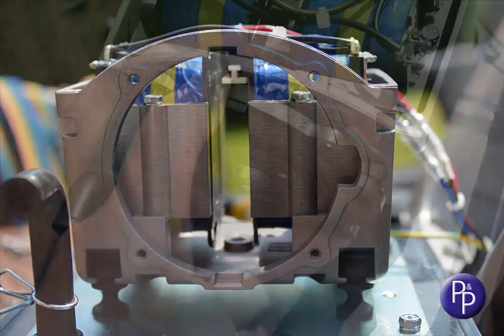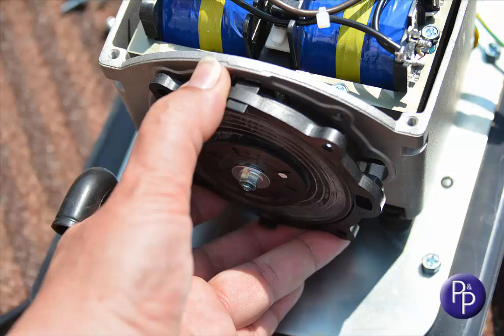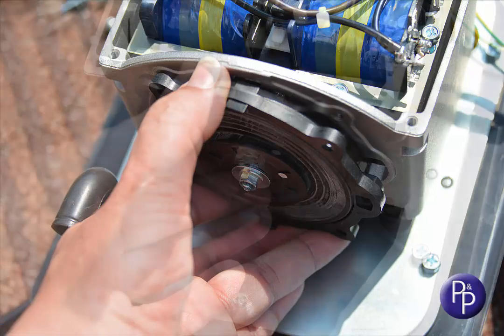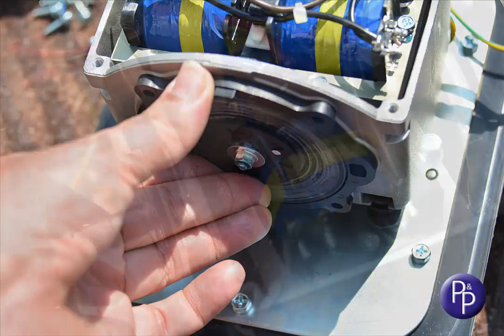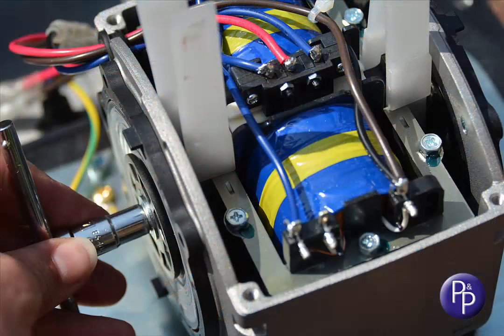Offer the magnet with the first diaphragm, already bolted on, back onto the casing. Be careful not to catch your fingers, as they tend to suddenly jump in because of the strength of the magnets. Now using the nylon spacer strips that come in the service kit, or now in the diaphragm packs, this will help you fight the magnetic pull of the magnets, which will really try hard to stick the magnet shuttle to one side of the slot or the other.